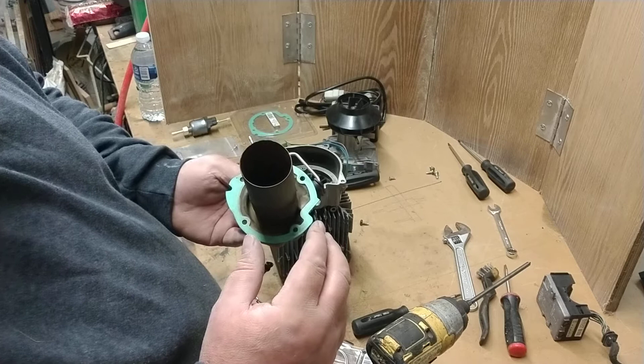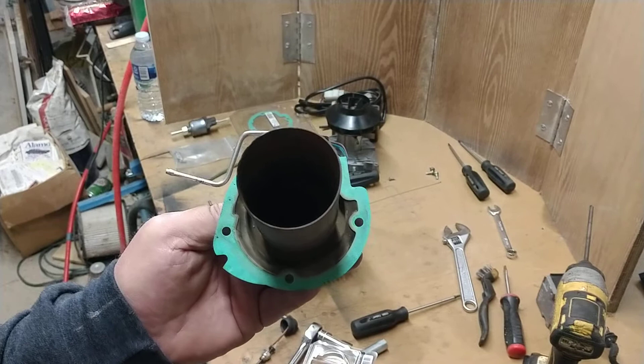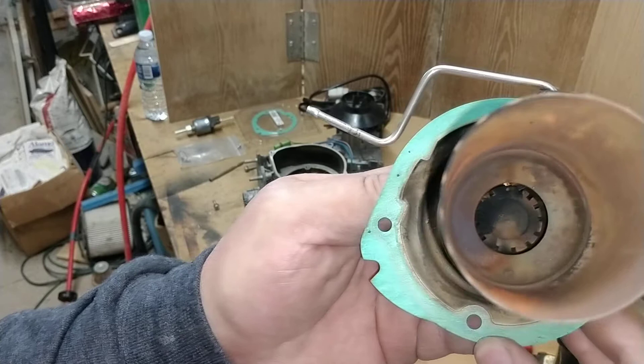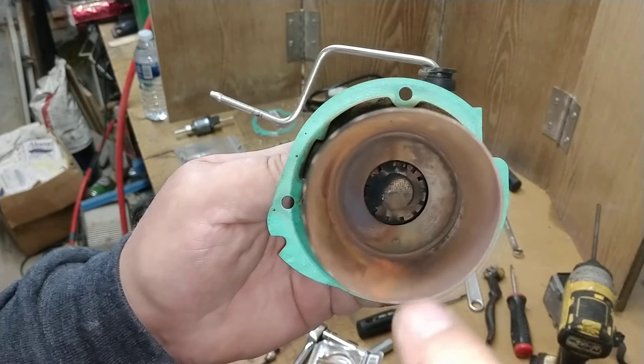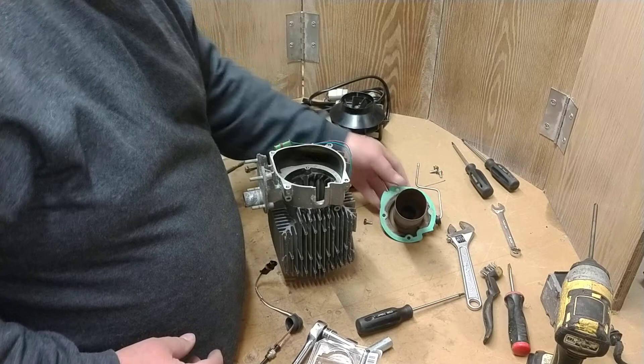I like to wear gloves, otherwise it's all over your body. Looking inside with a light, all those little holes are where the flames come out. When this thing is in failure mode or severely neglected, the inside is going to be covered in soot. Down at the bottom you can have a hard buildup of carbonized diesel fuel that is very hard to get out.